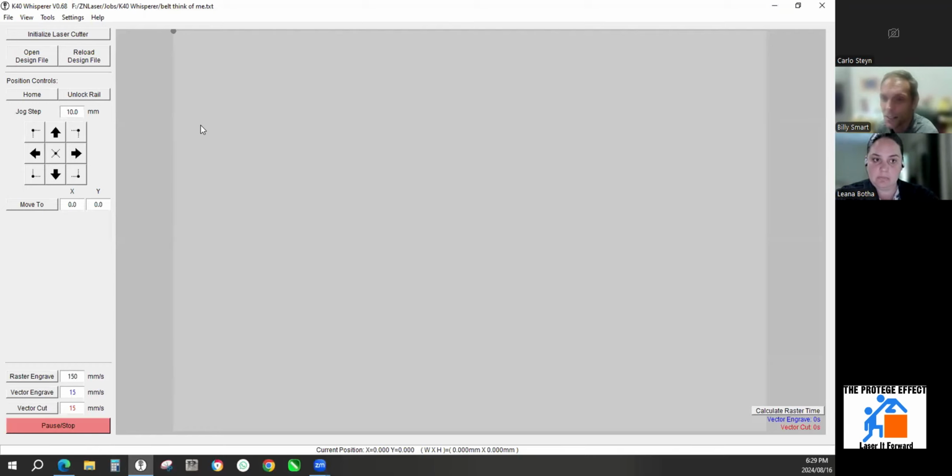If you just need to engrave an outline of something, then don't do it as a raster engrave. The job might take you half an hour for an A4. If you did it as a vector engrave, it'll literally take you 2 minutes. There'll be more information on how to use vector engraves and raster engraves in our general work.